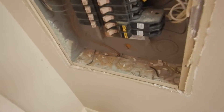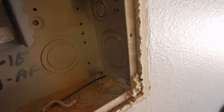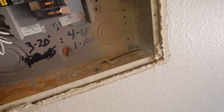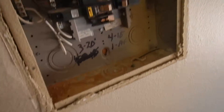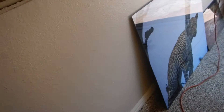There's a gap issue here, and another thing: these cabinets were screwed into place, but the manufacturer's installation instructions show a picture of a hammer and a nail. Screws do not have the same lateral shear strength that nails do. If this garage were to experience a tornado, and these things pop out, the first responders would be stepping over the sparky box to help you, because the main disconnect is all the way inside — there's no exterior disconnect, as it wasn't required when this home was built.